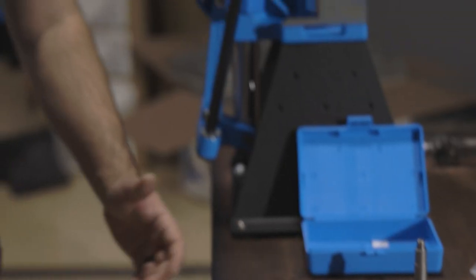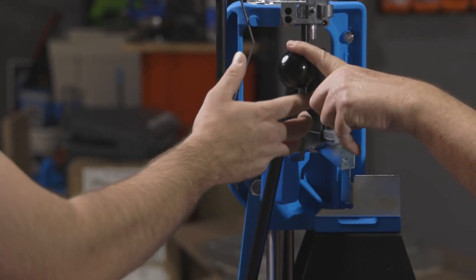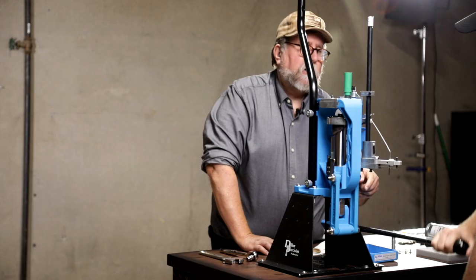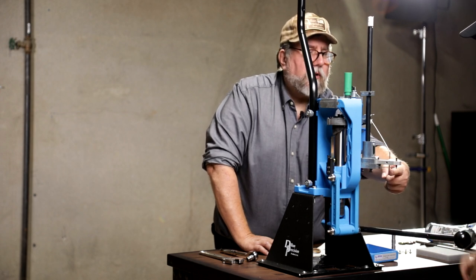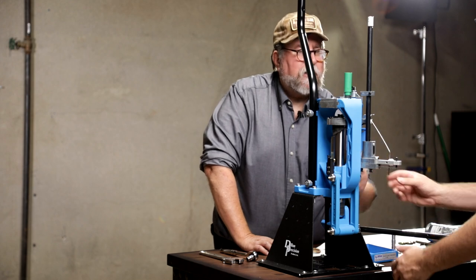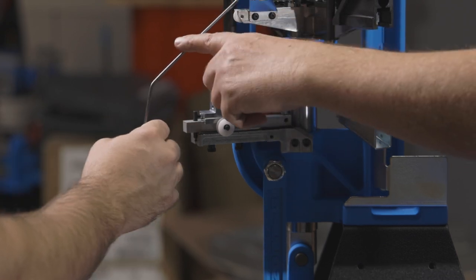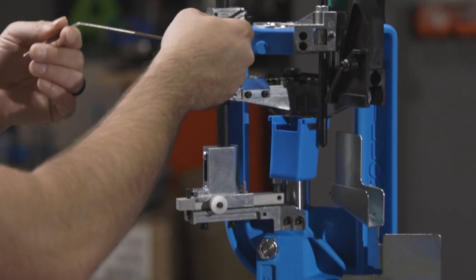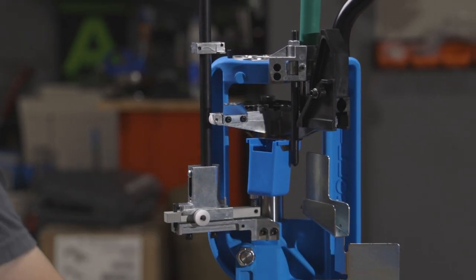All right. First thing you're going to want to do, pull the handle down to horizontal. Okay. Full pull? No, not full pull, just horizontal, like out to here. Gotcha. Now grab this rod and pull out to the other side of this roller. Okay, just kind of flip it out. It's just panel wire spring. Okay, take this off. Just slides out nice and easy. There we go. And set that down on the bench for now.